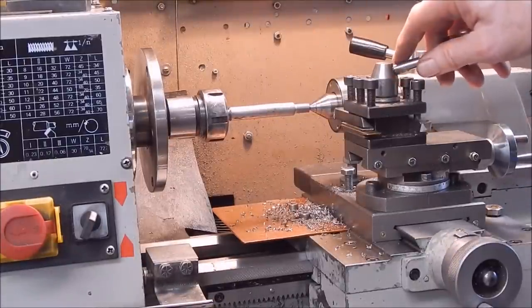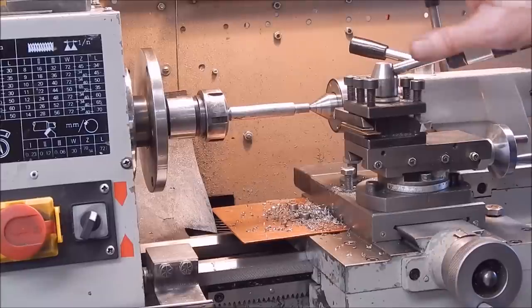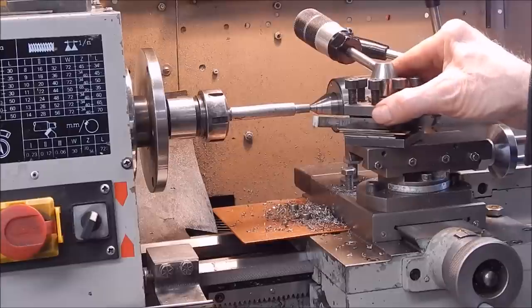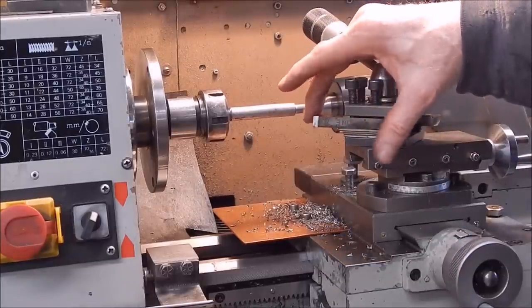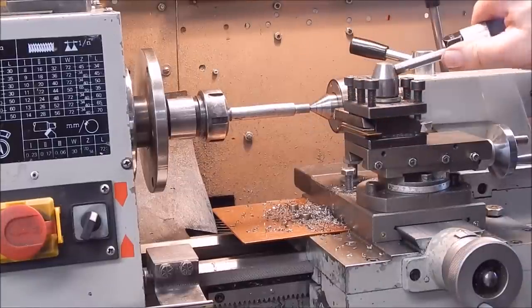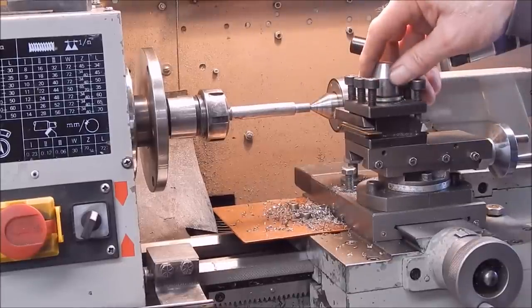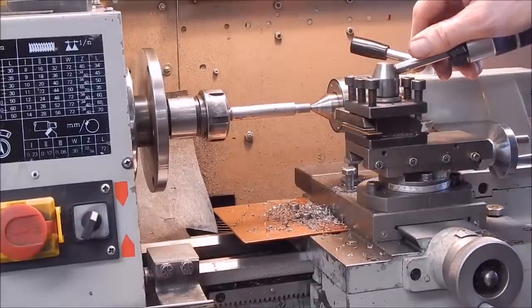You can reposition work, you can put knurled stuff in collets — it's great, everything will be centred, no marking. I've still got the shear tool in there from the last operation. Check out that video I did on shear tools — great finishing tool, and good for very finely reducing stuff. I'm going to get this little crossbar down to a snug fit with the shear tool, but for now I'll use carbide.